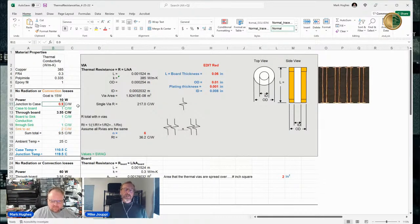With this package they have a different thermal resistance value for junction to case depending on whether you want the top of the case — that thermal resistance is much higher. I think it was about 20 °C/W, but I'd have to look it up. Let's back up a little bit and see if it's there. The thermal resistance junction to case top is 20 °C/W — that's the resistance from junction to the top of the case where he was measuring.